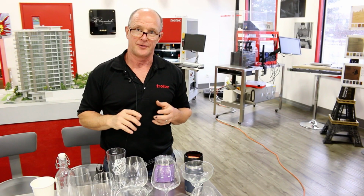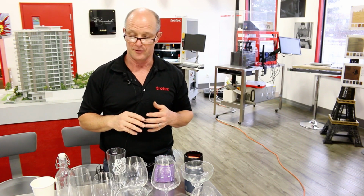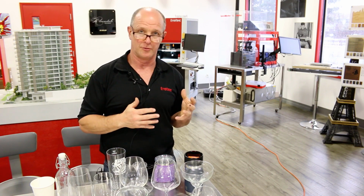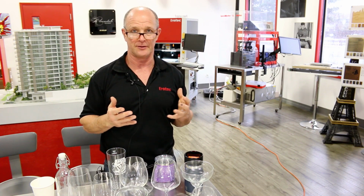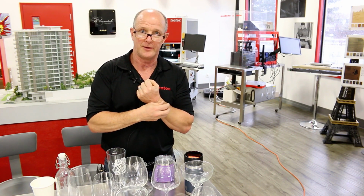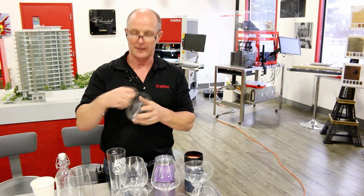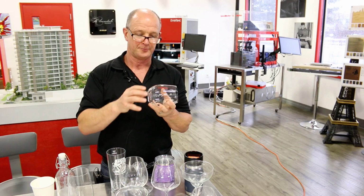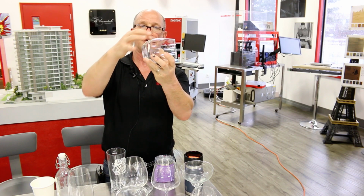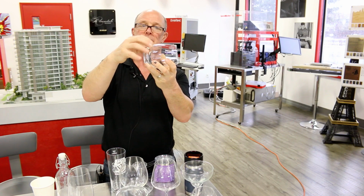One of the most important things that I tell people when it comes to working with the rotary attachment is that before we actually accept the order, we have to make sure we know where the logo is going to go on the glass, or the text or whatever the customer wants on that item that you're going to etch for them. For example, if you're looking at a glass like this, and we put it into levelness, we have this tapered off area here in the glass. Well, this is an area where I really can't put a logo.